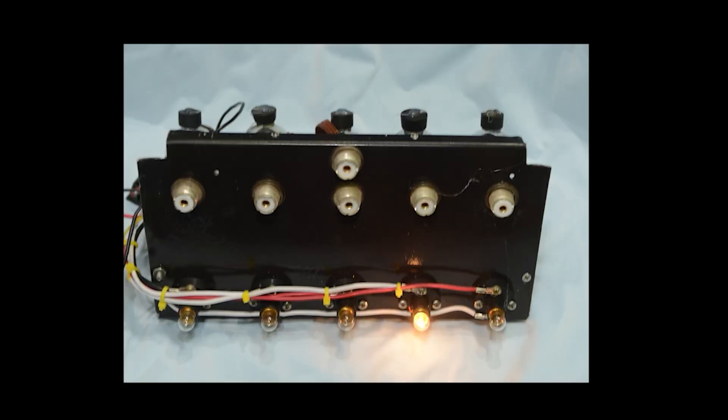I've got the five light bulbs for the five positions, and I dropped the voltage to them to 12 volts. That's my little relay box that is up on the wall. The negatives are that because they're single pull, single throw — like an on-off switch — there can be some crosstalk between the relays. I've got them tied together and right next to each other; I had to really push them together to get them to fit into the box.